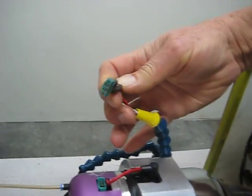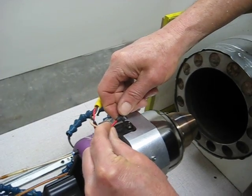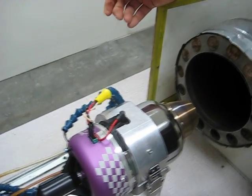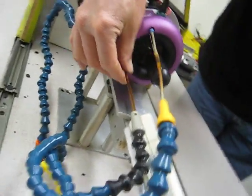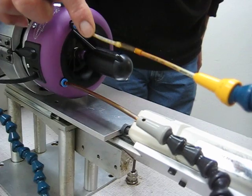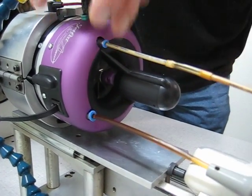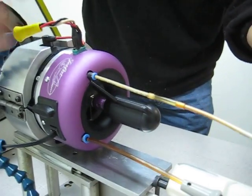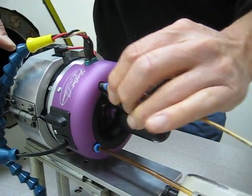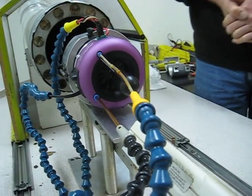The starter kit has a six-pin connector that plugs in here. This is the glow plug connector — pull the red wire back, push it on, let go, and it grabs. There's a data cable with an RJ11 connector that just snaps in. There are two fuel lines: the kerosene line, which is a 4mm OD tube, and the propane line, which is a 3mm line. They go into these push-fit fittings — push back on the blue portion, push in, give a tug, and it's locked.